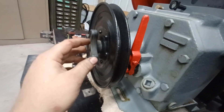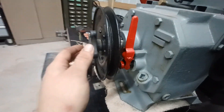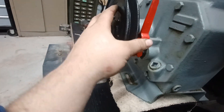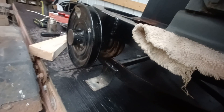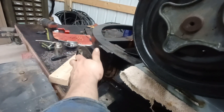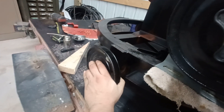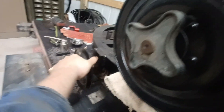This is the clutch — you turn this knob in or out to adjust it, so if the rotator gets hung up or jammed, this will spin and won't destroy the belts or the gearbox. It goes to a simple pulley wheel on the track, and you can see it rotates very easily. I'm barely applying any rotational force and it's rotating the whole entire siren — that shows you how free-rolling it is.